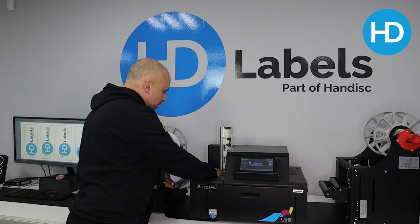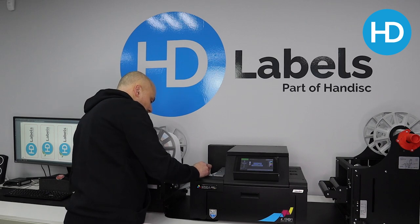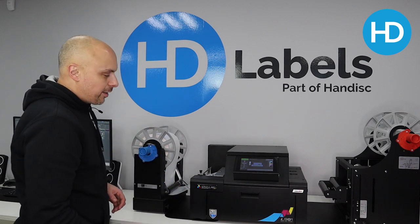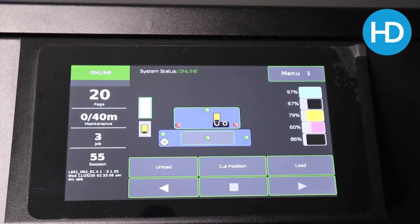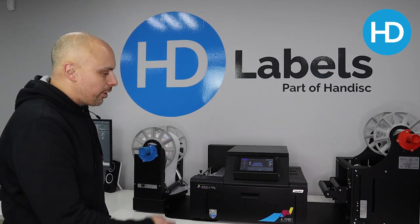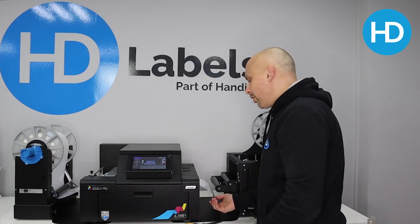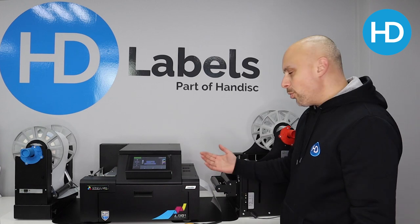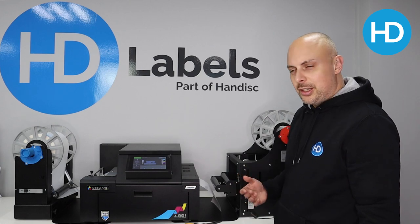We feed our material up to the entrance of the printer and down the clamp, move our guide into position, and then turn on the unwinder. On the machine itself we can choose Menu, then Paper Path, and slowly feed some material into the machine. You will see this working its way through. What we're looking to do is get some material out the other side. The material has come through the other side, so we can either stop and do a test print from here, or if it's going to go into a finisher you want a little bit of unprinted waste on the end of the roll. We could thread this all the way up to the rewinder and go from there, but what we're going to do is get it printing and see what it looks like.